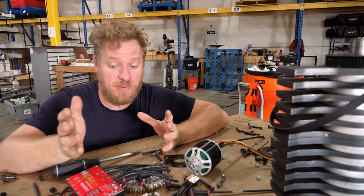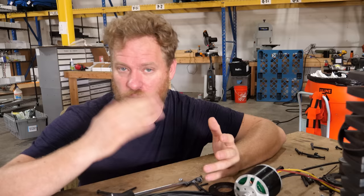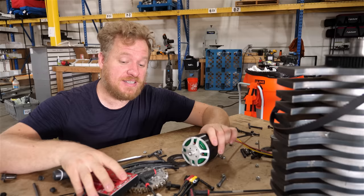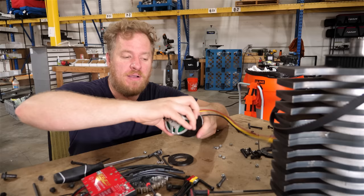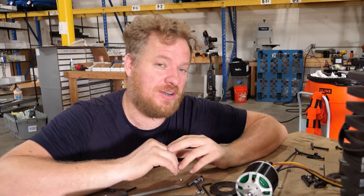We've decided to use brushless motors in Switchback. They're way more efficient for the given weight as opposed to the older school brushed motors, but they're way more complicated to control. In a brushed motor, you pretty much just give it power and it spins. You control the amount of current and that controls the speed and the strength of the motor. However, for brushless motors, this controller has to alternately energize different coils of wire every revolution of the motor. So it has to be really tightly coupled with the position and speed of the motor. And if you screw that up, all hell can break loose. Every bit of weight we save on the motors, we can put towards armor and weapons, but there's a lot of opportunity for things to go wrong and leave us completely dead in the water.